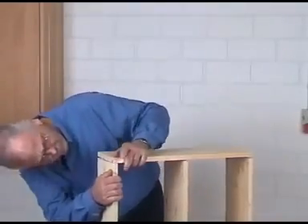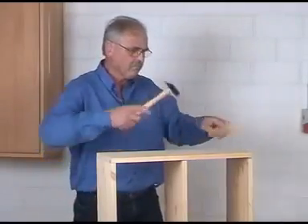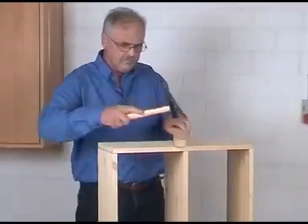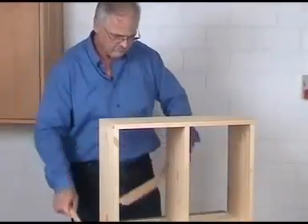Later a little bit of wood glue is put in the dowel holes and on the wood edges. The whole workpiece is fixed with clamps for 1 to 2 hours until the glue has set.